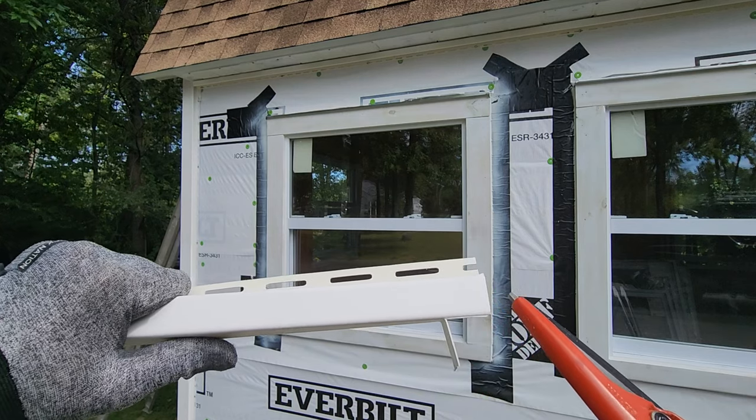Here's the final product — and one extra tip: if you look down the direction of the siding, you don't see any seams, and that's intentional. I started from one side and always worked in the same direction, so my overlaps are on one side of the siding. If you look at the wall from the other direction, you'd see those seams. Starting from one side and moving in one direction with overlaps going that way keeps your primary view nicely unobstructed. There's one wall left — this final end wall — and my wife was able to help me on it, which made the process go way faster. A final note: vinyl siding is not meant to be fully waterproof itself — it works with your house wrap to keep the building dry. So don't go around caulking the joints of your siding; that will just cause problems as it expands and contracts.